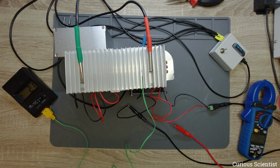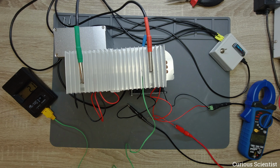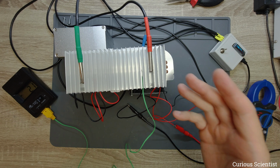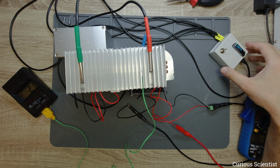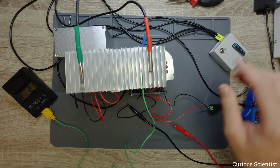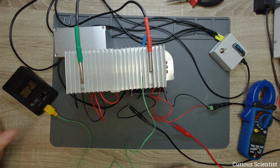And this is just one side. What happens here is we cool this, and we don't cool this part. I will also turn this on when we are using it in the cooling box. So we can expect very nice temperatures. In fact, this digital thermometer now measures 1.5 degrees Celsius, and the K-type thermocouple is measuring 2.1 degrees Celsius. So almost the freezing point. And I believe that in the box we will go below freezing point easily, because we will have 2 units and a closed and insulated environment.